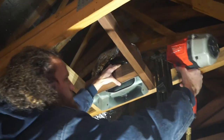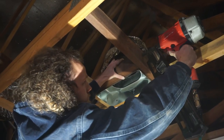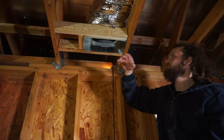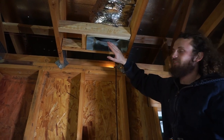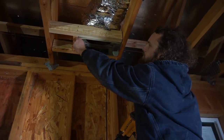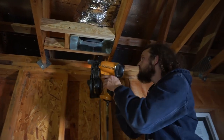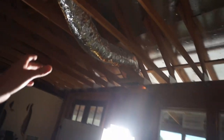First can's in. Locking this in is just basic framing — we're using 16s, the heavier nails. But for putting the ducts in, we don't need 16s, so we just grab the roof nail gun and hang it down about a half-inch low. Done. There's the first can we put in. This is just set in place — it needs to be actually ran and not kinked, but it's there for now.